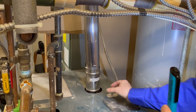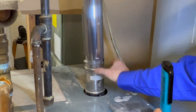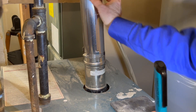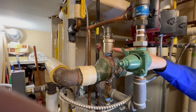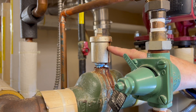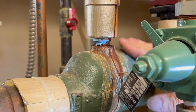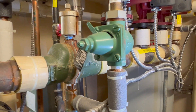There's actually an inner pipe inside the flue, and cold air is blown around it — so the outer pipe generally never gets too hot because the hot pipe in the middle has cold air around it. We have an overpressure valve right here: if the system goes overpressure, a little water will come out here, and you can see that's happened a couple of times in the past. This is very hot — 190 degrees — so you really can't keep your fingers on it for any length of time.